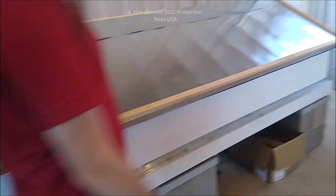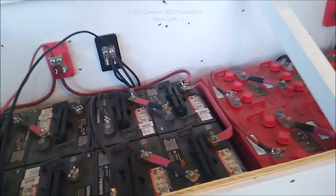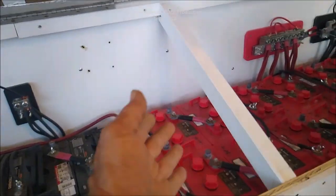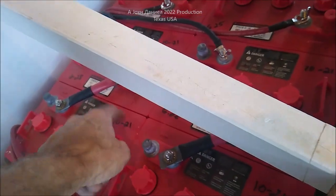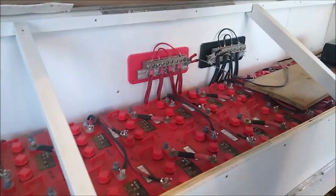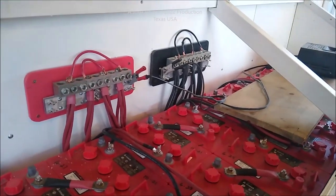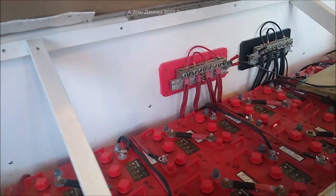Here is the battery bank. We've had solar hooked up to it for a while — there's a couple of 6-gauge wires. We were only putting in about 800 watts to maintain this battery bank, which is now four months old. I got these batteries at the very end — around October 22nd. I've kept them maintained, the water's fine, they're good — they're a 10-year battery. The bank is sitting there with a charger on it plugged into utility right now, just for a little while, because that little controller took a dump. So we've got solar sitting on the roof doing nothing.